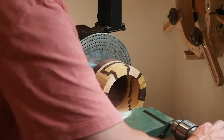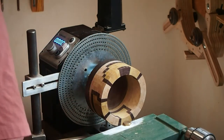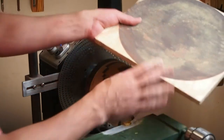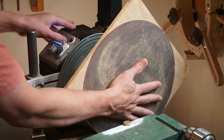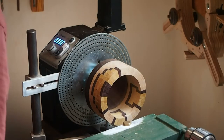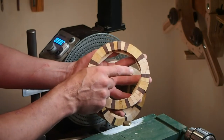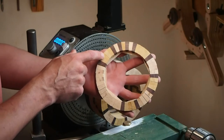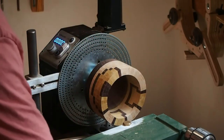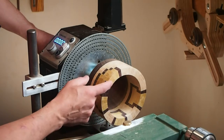I just finished sanding this ring. In between each course, you're going to have to sand, and this brings up a very important point — sanding isn't fun. You take a sanding board like this, lodge it in there, and away you go. You'll do a lot of that if you're not careful with the way you milled your segment stock. I've got three different species here: catalpa, maple, and yellow heart. When I milled the yellow heart, I wasn't very careful and some of them are just a fingernail-catch different from the one next to it. They've all got to be even in the end, so be very careful about your milling so that you don't spend as much time as I do between rings.